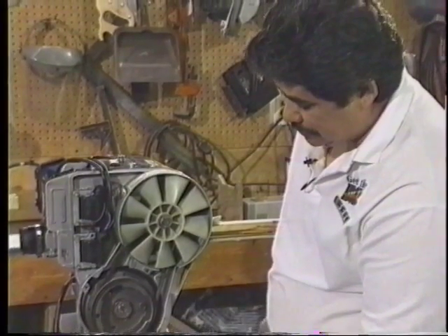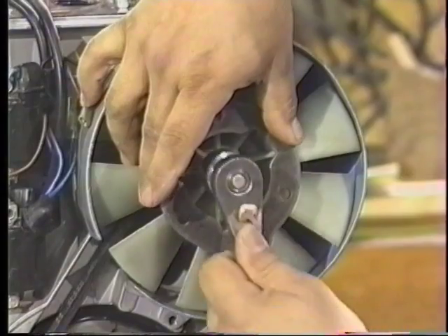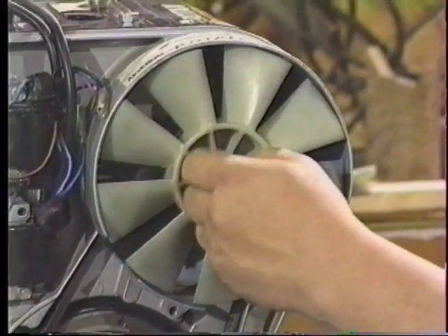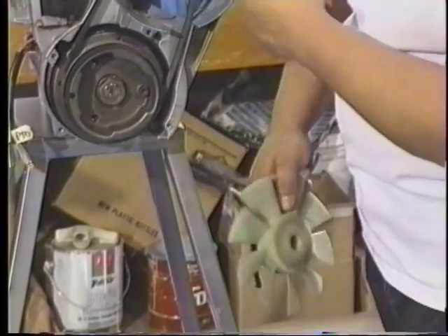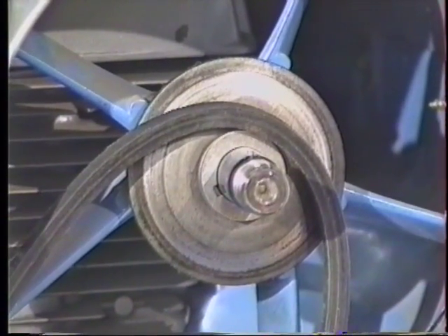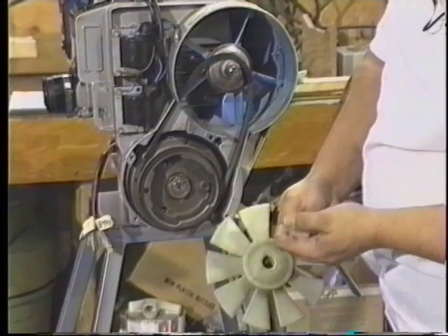This one is loose enough to adjust. So what we do is we take our fixation tool that we talked about earlier and apply it to the fan. We take our wrench and we loosen the bolt that holds the fan on. What we'll see inside is that the fan will run against the belts, or there will be a washer running against the belt at that point. We also have here shims, a number of shims that are applied to the shaft. By changing the distance between this half and this half, we can tighten the belt and force it out further.